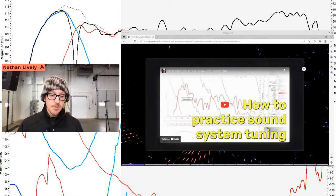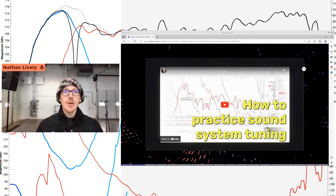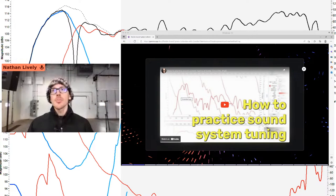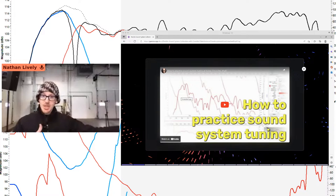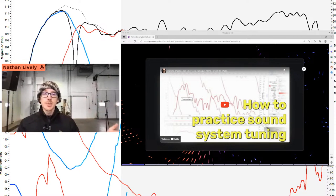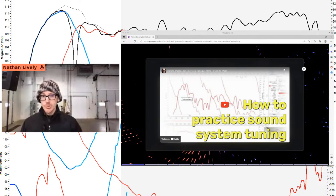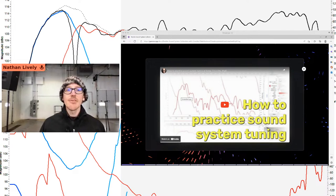When I go to work on a show, let me tell you how it used to be before. So a year ago, I would show up, I would set up the sound system, and then when it came time to do my calibration work, I would usually deploy like 5 or 6 microphones, as many as I could get my hands on, right? And then they would pretty much stay there for most of the work, and that's how I would get lots of data and do averages and things like that. And I would be playing pink noise into the room for anywhere from 30 minutes to an hour, as long as I could get, as long as we have for sound system setup.